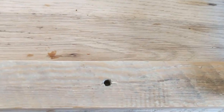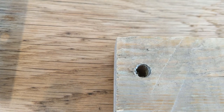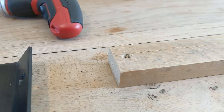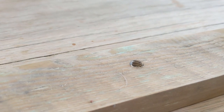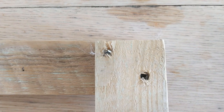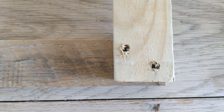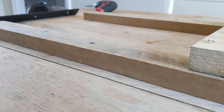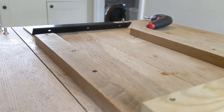You've got four holes here. I've drilled mine out to maybe five or six millimeters, because that is the width of the shaft of the bolt I've been using to bolt the pedals to the frame, which you'll see a little bit later. Two wood screws either side, done in a way to stop the bridging piece of wood from twisting. I've drilled a hole out so that they can go deeper without splitting the wood — and there you have it, that's the frame without the pedals attached.